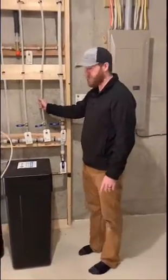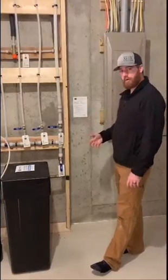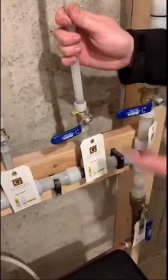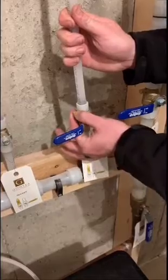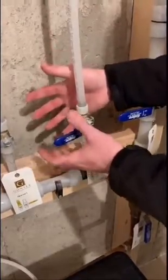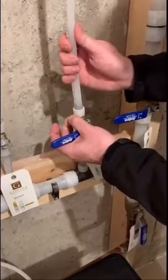The other shut-offs here are your outside spigots — we put a sticker on the wall telling you how to turn those off. What you want to do is turn both of these off, go outside, open the spigot to drain any remaining water in the line, then come back down here and open this relief valve to let any extra water out. I typically take a towel, hold it around it, open it up, and then make sure you close that back up and tighten it well. Leave those off until the following spring when we get out of freezing weather.